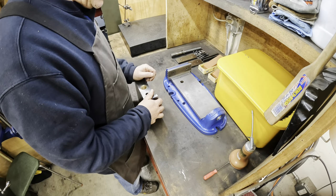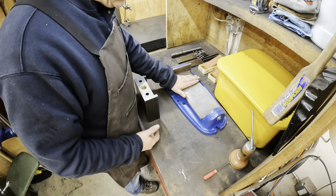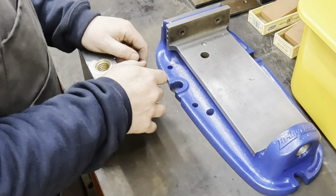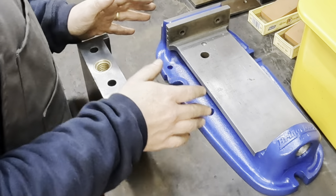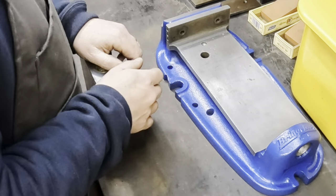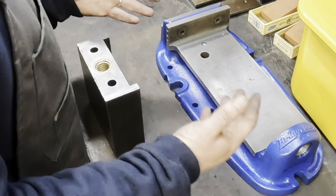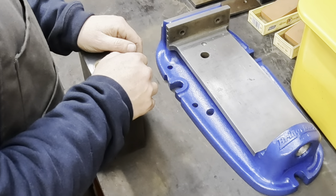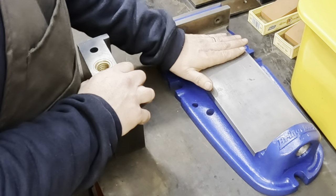I'm going to move the vise over to the surface plate here in just a minute. I want to check the parallelism between the base of the vise and the bed. We know that these Bridgeport vises have some limitations, especially compared to the Kurt vise, particularly when it comes to lift. If you have a piece of work in the Bridgeport vise, it can tend to lift - you have to be really careful to pat it down. As compared to the Kurt vise, it has that angle lock which really drives the part down. So this is not a super accurate vise, but I'm curious to see what these measurements are.